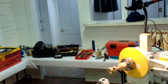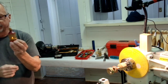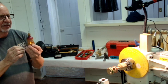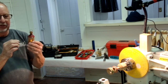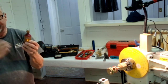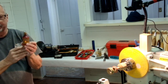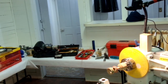If you turn it thin, without drilling any holes at all, then you can go back and pierce. It's got to be 1 or 2 millimeters thick to be able to pierce fairly easily. I don't know how many of y'all have done piercing. You can do piercing with a Dremel if you have a real steady hand. The problem with the Dremel is it wants to follow the grain because it's only running at less than 50,000 RPM. The high speed ones that they actually do piercing with run at 400,000 RPM, and they're literally like writing with a pencil. They don't follow the grain at all.